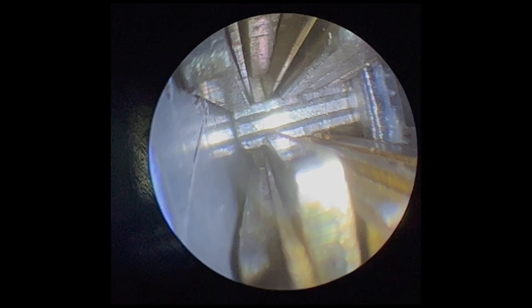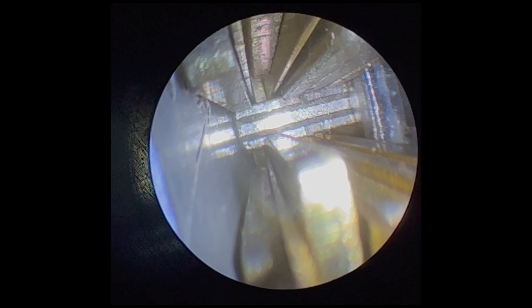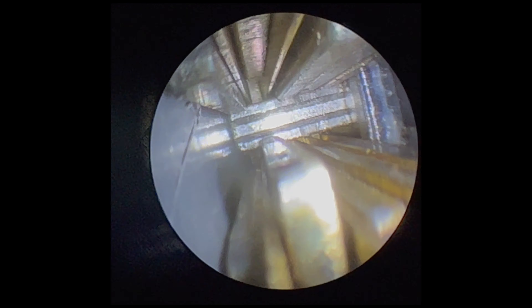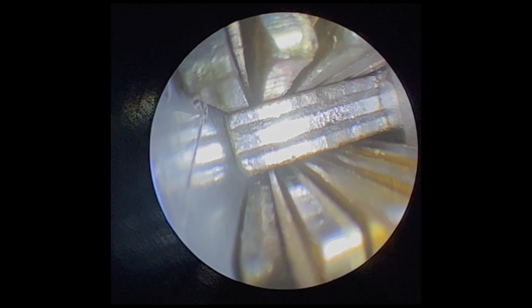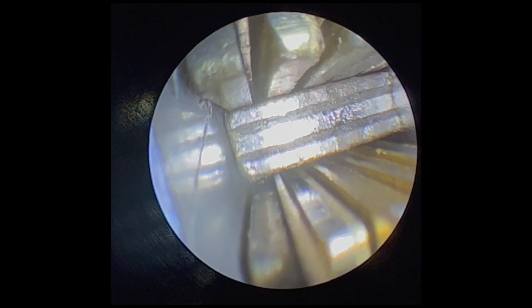There's lever one going up out of its anti-pick. Let's go to two - there's two gone up. Let's go back to one and make sure that's in gates. Lever three is still very much in its anti-pick - there we go. Five, four, three, two, and one are all solid. It looks like lever two has been over-lifted and it's catching on the bottom of the bolt stump rather than the top. I just gave that a little gentle nudge and we've now got the lock - you can see the bolt stump passing through the true gate in the levers.